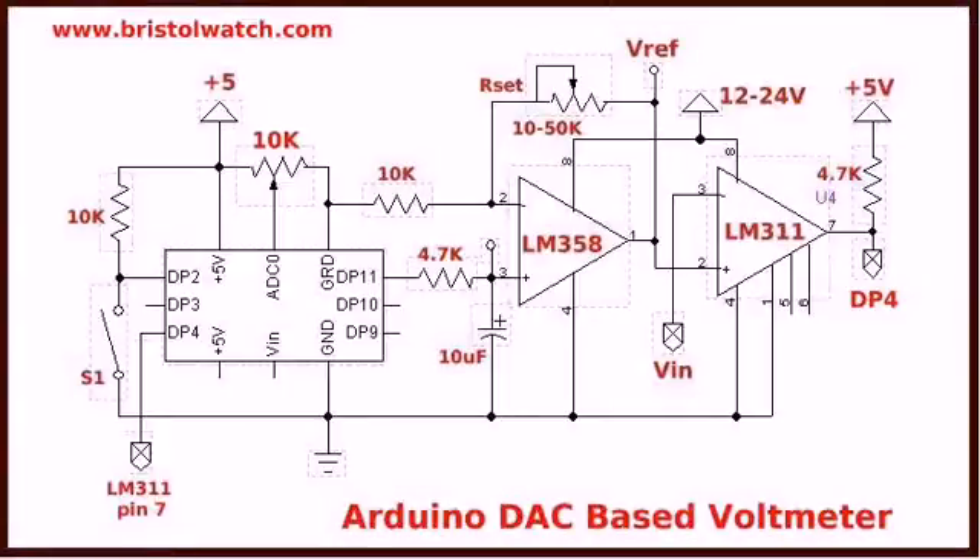Here is the basic circuit that we saw demonstrated back in the video. I left out the voltage follower stage in the drawing and went ahead and used the LM358 directly as an amplifier. In this case, I have substituted a 50K pot that, when used with this 10K resistor, can give me a voltage gain of something like 1 to 6. So by adjusting that pot, the 0 to 5 volt output on test point 3 can easily be 0 to 22 volts on V reference.